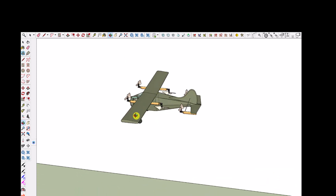And this is an airplane that flies. It already flies. So you don't have to worry about, is this thing going to work? Because it already can fly. It's very famous. And all you're doing is creating 5,100 pounds of vertical thrust to make it go straight up in the air. Then what you do is you turn these 2 down so that they start making it go through the air this way. As it speeds up, it needs to get to be about 60 miles an hour, which is not very fast. Lift from this wing will be equal to 5,100 pounds, and you can turn these off. They don't have to do anything.